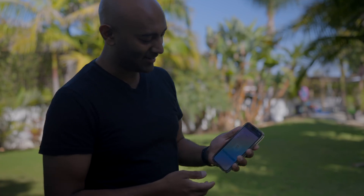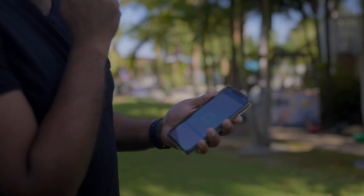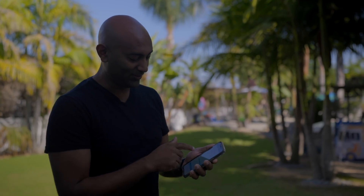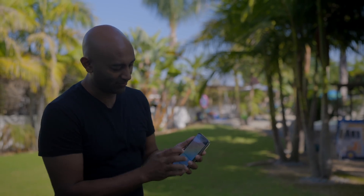Now you can track how much water you're using — but why should you care? I have a lot of yard and if I had a leak somewhere I wouldn't really know until my water bills came in. After a couple days of running with the application, it told me I have a water leak. You can check on the screen and see exactly what's going on. The spikes are normal — that would be like flushing a toilet or running a sink. But that baseline is not zero, which means that every second of every day, water is leaving my property.